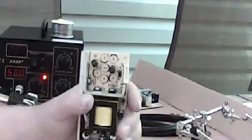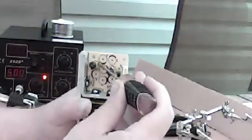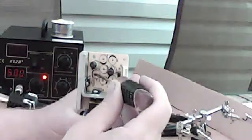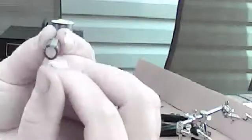is this little black line right here on the board, the thicker line on the top of the circle. This circle over here has a thicker line on the bottom of the circle. This one over here has a thicker line on the side of the circle. Well, that corresponds with this thicker line right here on your capacitor. Alright, it's right there. So this is not rocket science.